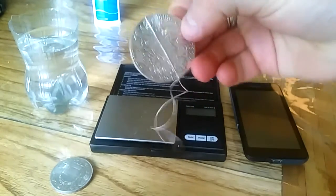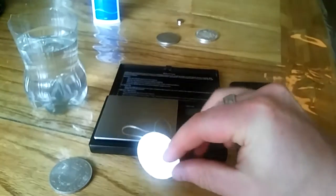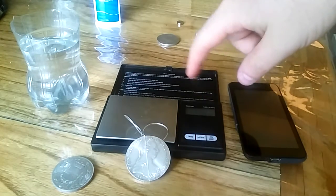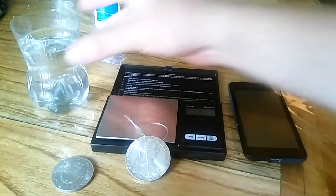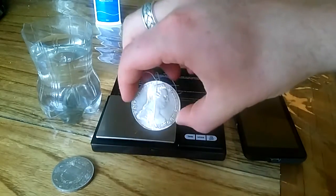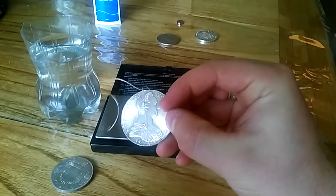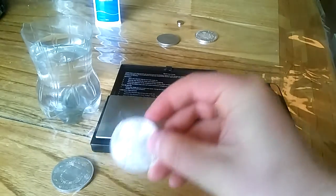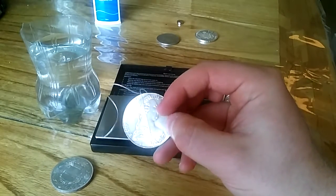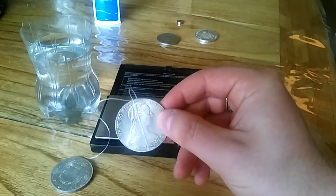So I wanted to do a specific gravity test. If you're wondering what the little string is, I've tied a bit of dental floss to it, pre-tied it, because it's a bit tricky to tie under pressure on camera. Things you need to do a specific gravity test are really easy to do at home: weighing scales preferably accurate to 0.01 grams, something lightweight you can put on your scales with water in it, and a calculator. You also need to know the silver content of the coin you're testing. These Maria Theresa's have 0.833 silver content and the rest is copper, 0.166. A little bit of maths shows we're looking for about 10.2 as a result for the specific gravity test.